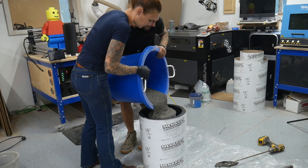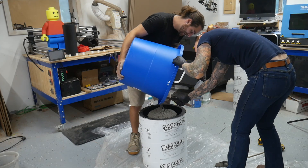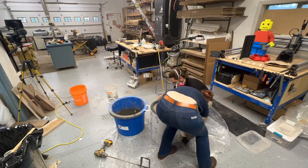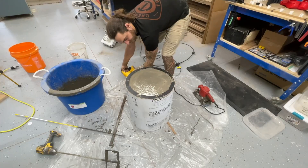Now let's get back to pouring some concrete — and pouring concrete we are. This batch felt a little thick, so I mixed the next batch a little more loose. We used a stick to kind of mix it together, and then we used several different things to try to vibrate it, but this Sawzall actually worked the best.